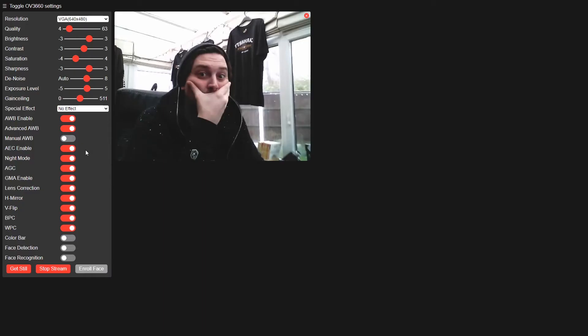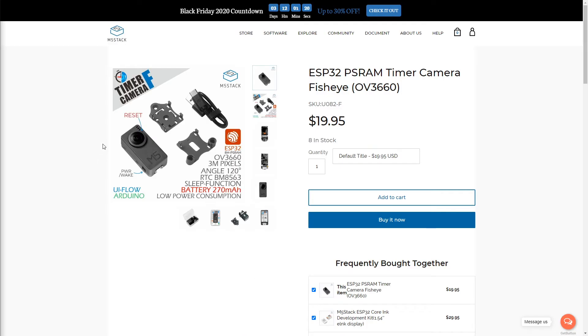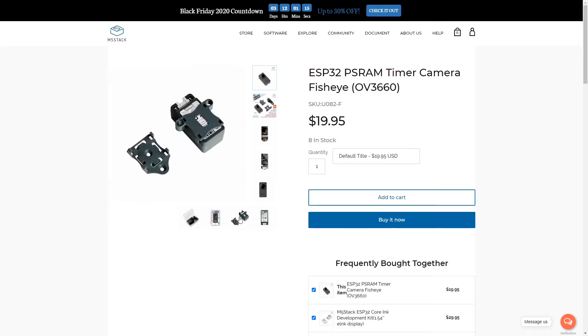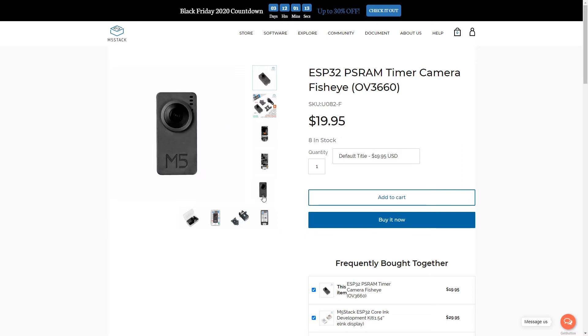This little thing has a 3-megapixel image sensor and a focusing ring that makes you feel like a giant. The lens on this camera module has a 66.5-degree field of view, which is great for webcam use and the like, but it's a bit narrow if you're going to do any security camera type stuff. M5Stack just the other week released a Timer Camera F, which seems to be the same product but with a fisheye lens, so that would be worth considering if your project requires a wide-angle camera.